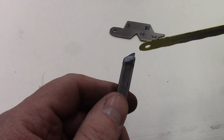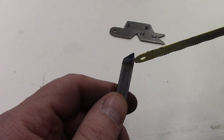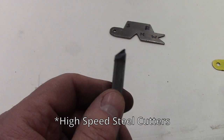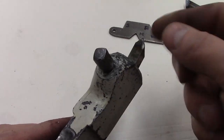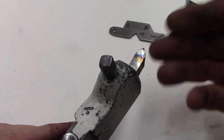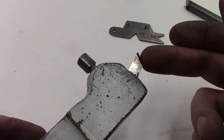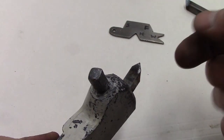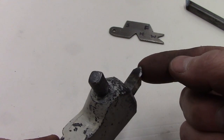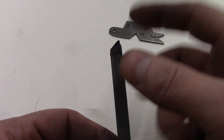If this tip gets destroyed, to fix it you've got to grind it all off again to reshape it and you're going to go through a lot more steel. On the other hand, my cheating way doesn't give you as nice a cut. However, for high school kids, this is going to save you a lot of time sharpening lathe cutters — just a quick touch to get a new tip on there and this thing is going to cut just fine. If you want to get fussy and do a good job, this is the way to go.